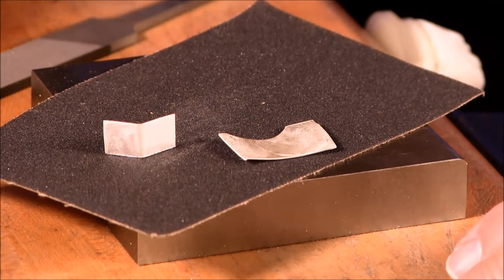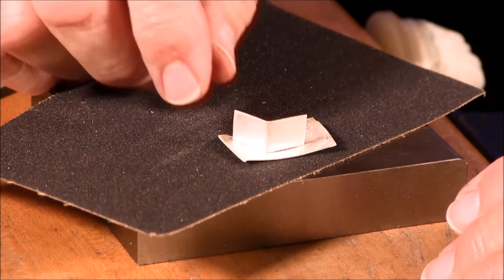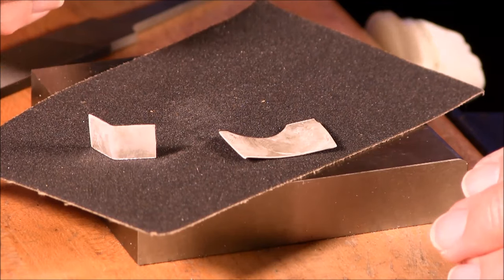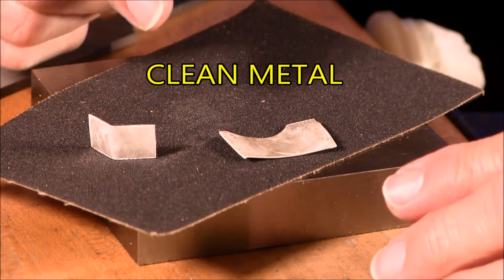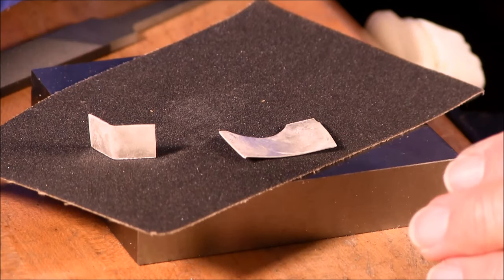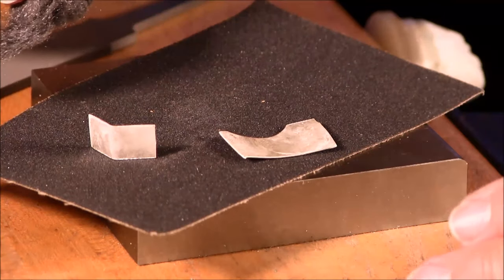Now let's take a look at sheet metal. Here are two pieces that we're going to be soldering — I'll solder this one on top of the flat sheet. Again we have our secrets of soldering. The first one is clean metal — I've pickled these so there are no oxides on them, and we can clean them up with emery cloth, emery paper, steel wool, scotch brights, and ultrasonic cleaning.